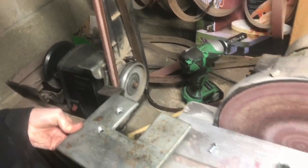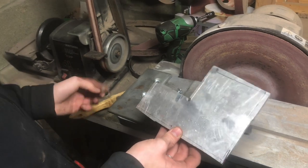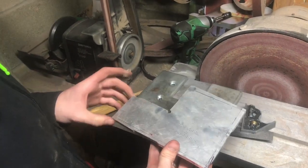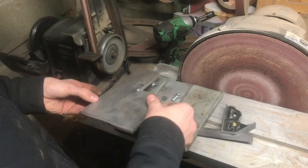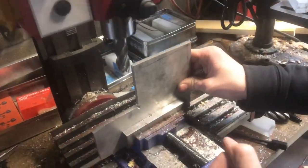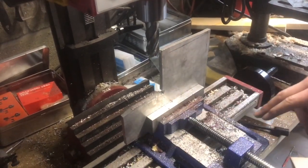So what I'm going to do is make just a new table. It'll look a little bit nicer as well. I have this piece of aluminum that I very roughly cut out with the Sawzall, and it's just going to be a better shape overall. I'm going to make my rough cuts on the milling machine. I just have it traced out with a Sharpie and some scribed lines.